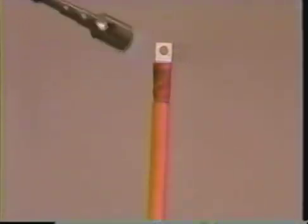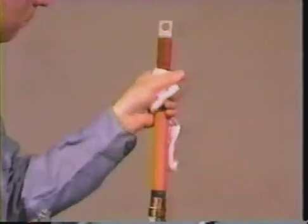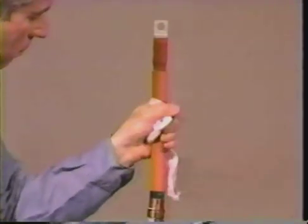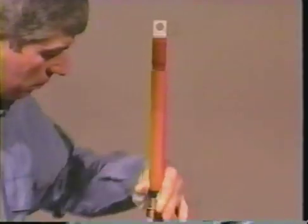If you are working with 5, 8, or 15 kV, no shim will be required. Now, abrade the insulation if necessary to remove any embedded Semicon. Then, using an approved solvent, clean the cable as shown.